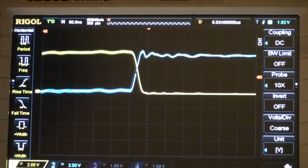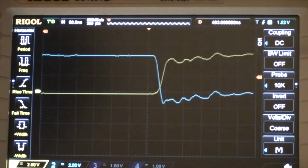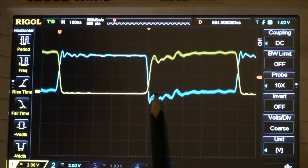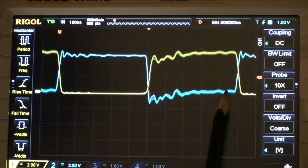We're going to go over to our trigger condition, and then to this first one. This is a 1N4007 measuring at the moment, and it's going from here to about maybe here somewhere. It's having a bit of positive for some reason there, but this is really noisy because there's barely any current through it.